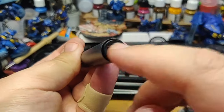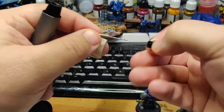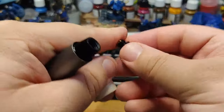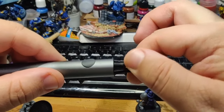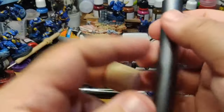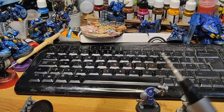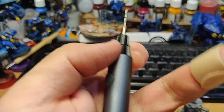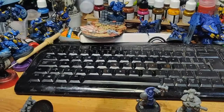It is USB-C rechargeable and comes with a USB-C cable. It comes with eight bits — you just unscrew the front. Don't lose the brass bit which holds the drill bits in place. Here's the bit I didn't get to start with: if you've just finger-tightened it, when you turn, the whole drill turns — so it doesn't get any tighter. The problem is the bit is still loose. You just need to pinch the end of the drill to give it a little extra tightening — literally two or three ridges worth — to hold it in place.